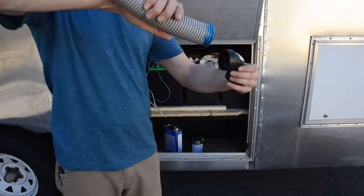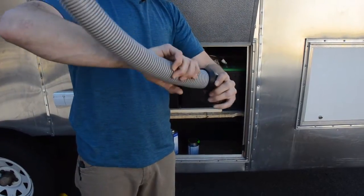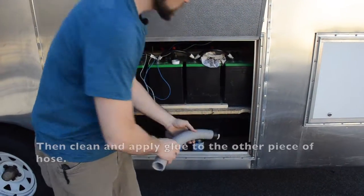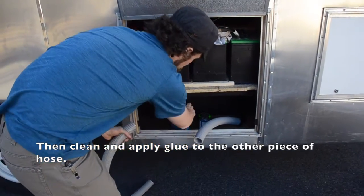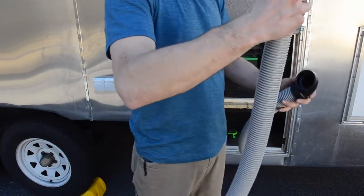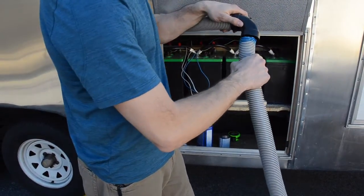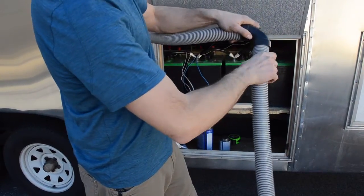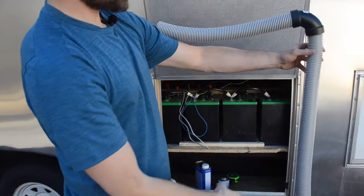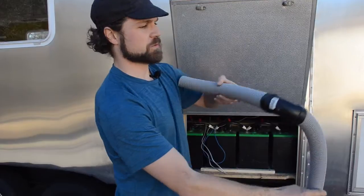I'm going to do this the same way you would with a pipe, by dropping the elbow on the ground. It's got a natural bend to it — I want that to go up. So I'll give it a quarter turn and then a quarter turn back as I push it into the socket. There's no threading in this elbow, but I'm giving it a quarter-turn anti-clockwise because that's the way the threads go. Push it in with the quarter turn, and that's going to sit with the opening so this hose comes out going up to the toilet. We'll lay it flat on the ground so it doesn't pull out while it's curing.